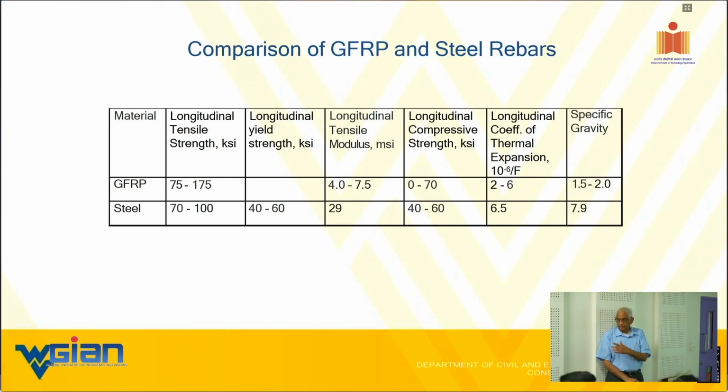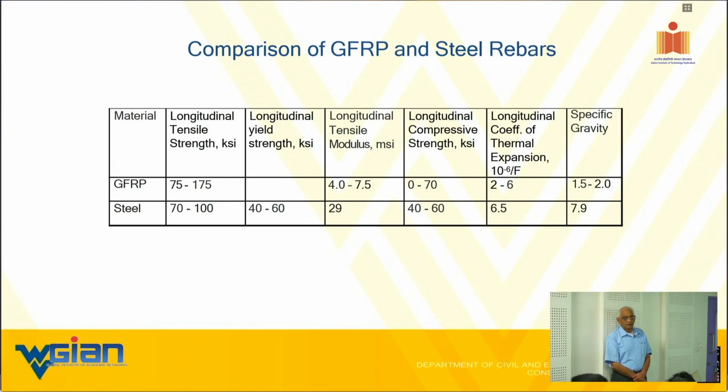You're with me? So why is E-glass preferred over S-glass? No, the manufacturing is slightly different, but both are glass. But the message is E-glass is about 10.4 million psi, S-glass is about 14 million psi. Why is E-glass more used in infrastructure? Cost. That is the issue. Where you need strength, because S-glass is 50-60% higher, you use S-glass. So what did I say? I said computations of stiffness are much easier with a composite than the strength. That is my fundamental message.